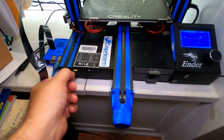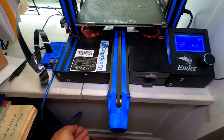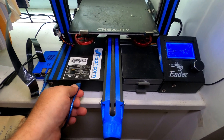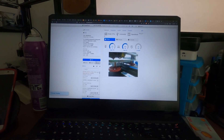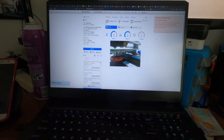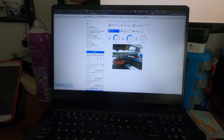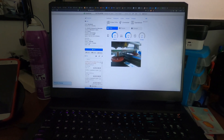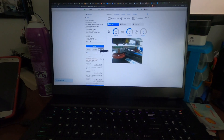Go ahead and take the SD card out, hook the Pi back up, and get back to trying a test print. Here's another problem I ran into — fun stuff with 3D printing. Trying to print via OctoPi, and I'm missing some settings needed for Octolapse, probably because of the new laptop or the new board, so it's not wanting to print. I'll load the file onto the SD card and print directly from the machine itself.